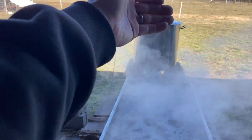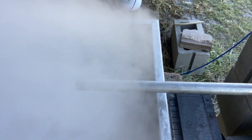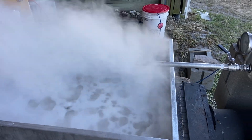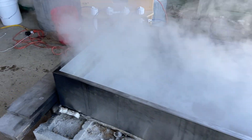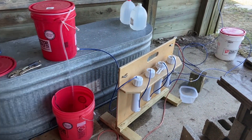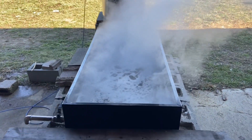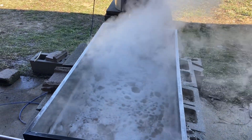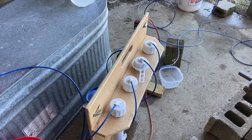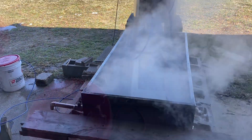The RO pump puts it up in here and then we drain from here — here's our valve coming in. What we're trying to do is match the flow coming in with the evaporation rate. On this RO we're pulling out about 10 gallons of water an hour, and when we really get this evaporator going we're doing another 10 an hour, so potentially 20 gallons an hour. That's enough for us with under 50 taps.